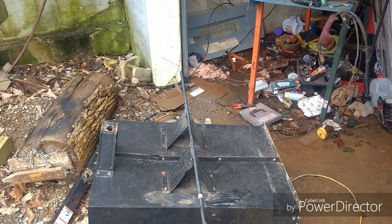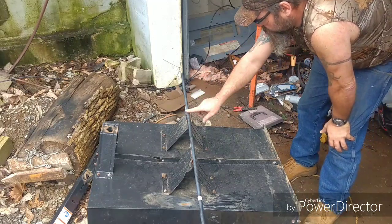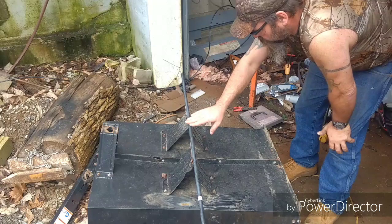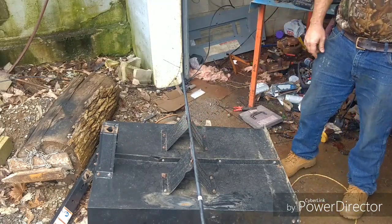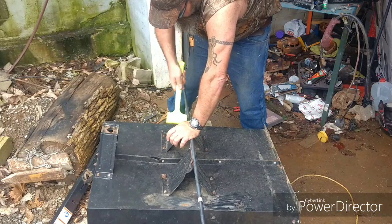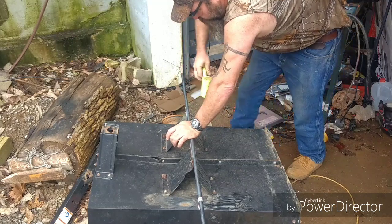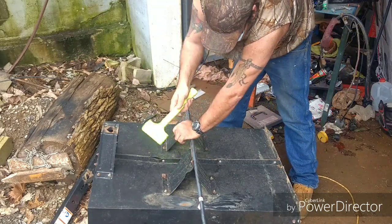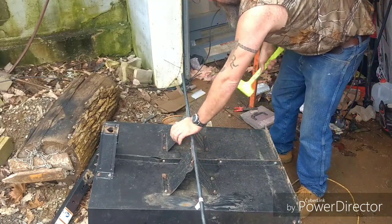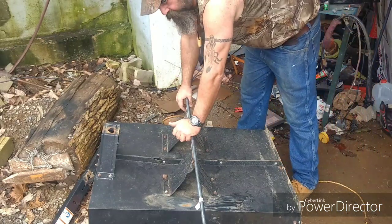All right, so what I've done here is these little clamps that were bolted together around the old axle, I went and cut them off after I removed the old axle, and then I put the 5/8 rod in there and hammered it down so that these old ones will clamp around it. Like that. And now I'm going to form this metal up around the sides. Like that. Around the new axle. So now I've got that set where I want it. The axle should be fairly straight. Straight enough anyway for us.